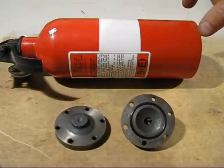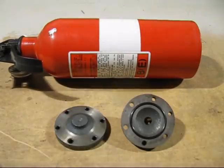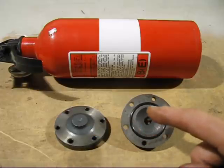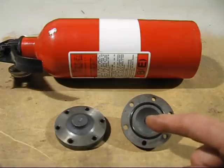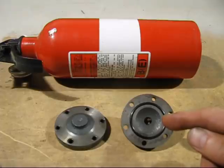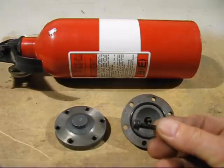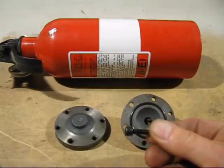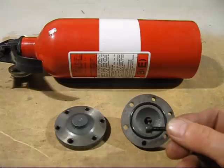What happens is this has to be a lot thicker. If it's the same thickness as the wall, it will balloon out. The same goes for the covers here — underneath you'll see there's a hemispherical shape, so the pressure is even all over. If I made this perfectly flat it would need to be very thick, and the screws that hold it on would have a lot of pressure on them, pushing them out of the threads or stretching the bolt. That's why I use the hemispherical chamber — it makes things a lot easier and you don't have to put excess pressure where you don't need it.